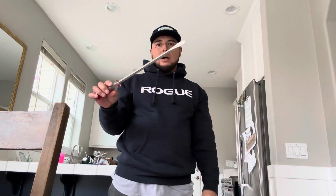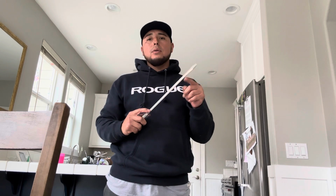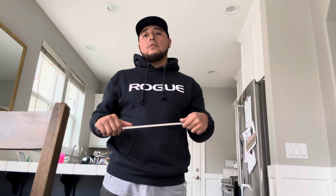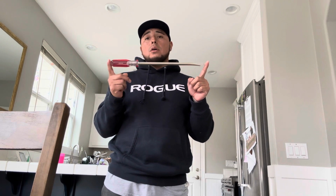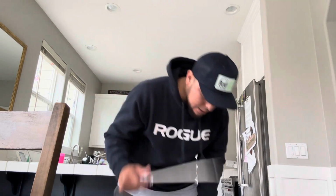Long screwdriver. This is the smaller of my two. I got a longer one. Now this is for when you're walking around the exterior and you poke at the siding, you poke at the trim, you poke at the rafter tails, the fascia boards if they're accessible, right? And so this will let you know if it's soft and compromised, if water got into the wood, if it's rotten. So you need a probing tool.